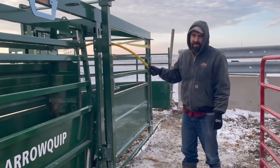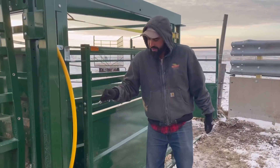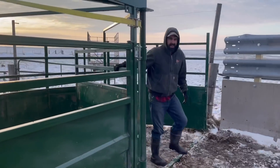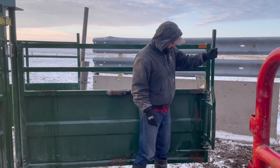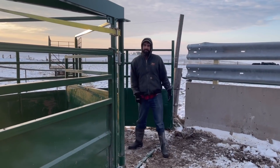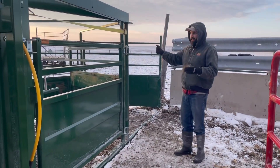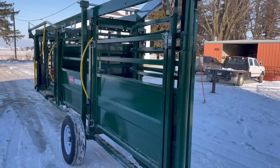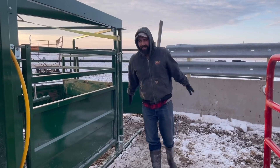You've got your second door back here to get in and out of the tub, to let cows in, and then to stop them from backing back into the tub. There is a sort gate right here — if you want to let somebody out of the tub and can't go back that way, you can let them go this way. All this stuff is pretty quiet. I think this is a standard 8-foot tub. It's got a spring-loaded lever over here to keep the tub from opening back up. This chute does have a folding tub, so all three sections of the tub fold up on each other and come clear up against the frame. The chute ends here when you're pulling it down the road, so it takes eight feet off the length and it's really narrow when you're going down the road.